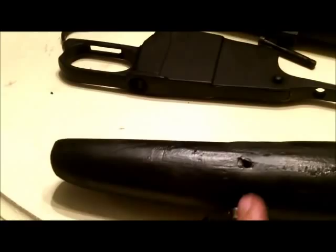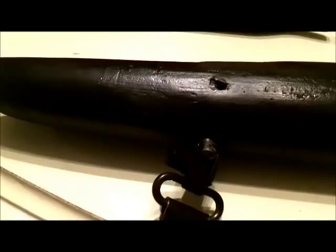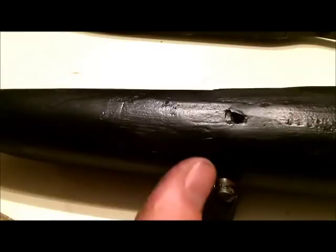I added an end cap because once I shortened the stock it ended up being too short and rounded and looked ridiculous. This end cap starts right in front of the sling swivel and goes all the way forward. I found a video that Larry Potterfield did showing how to do ebony fore-end caps and I just used that concept. What little barrel channel there is left has been completely free-floated — it doesn't touch the barrel at all. Normally that wouldn't be good on a Mosin, but one with a barrel this short doesn't have enough flex for it to matter.